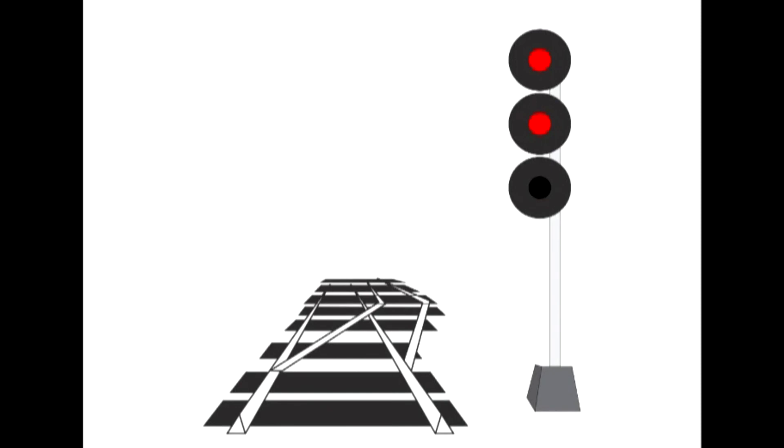You can figure out the various combinations you can get — basically they've upgraded the placeholder to represent a restricting signal up ahead. Now, if they are all red and the bottom one is flashing, that means take or leave the siding or other track. If we're taking a switch onto a branch line or into a siding, that signal simply means the switch is lined for that other track and you're going to take it. CN uses a flashing arrow in advance to indicate if we're going to take the siding, and then we get our speed indication at the siding signal itself.